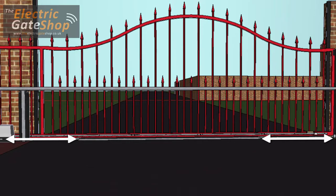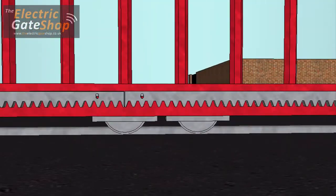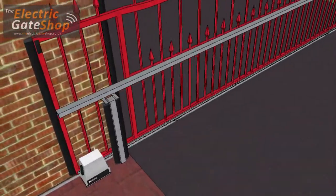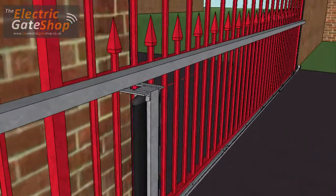This formula allows even weight distribution over both rollers with bias on each end to stop the rocking effect. On particularly heavy gates, you can fit two pairs of rollers, as shown. The recommended practice to support sliding gates is using a C-channel, roller and support post. The C-channel is fitted mid-height on the inside of the gate and runs along a pair of rollers attached to a support post.